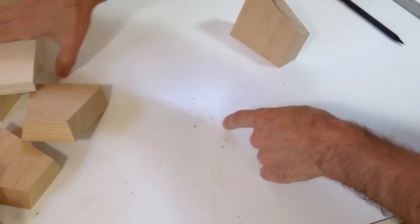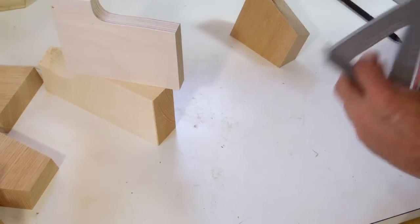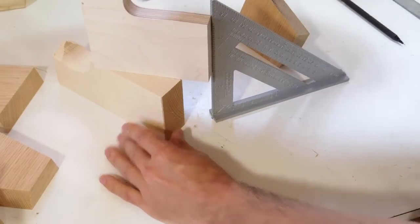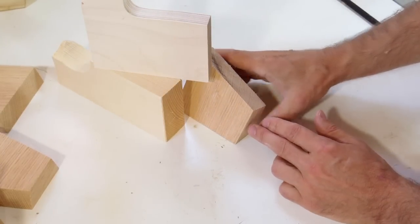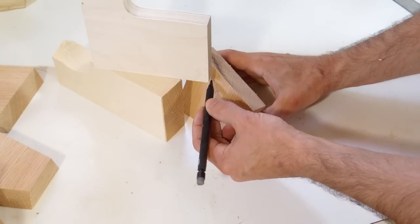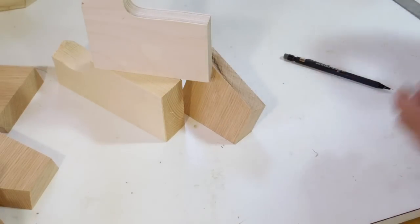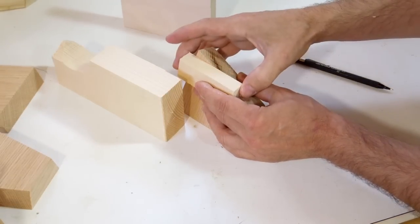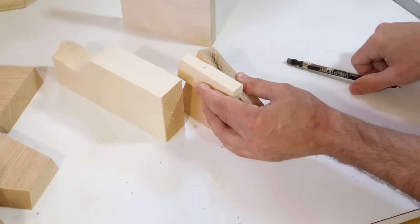Let's try to figure out how to project that down. I'm going to use some pieces of wood and get this piece right over the corner — the center that I want to clamp. I can tell the center of clamping should be right about this point here. This is going to be tricky to clamp, so what I'm going to do is clamp some bits of wood to here — if I clamp this piece of wood on like so, then that center of clamping ends up here and I have a place to put the clamp.